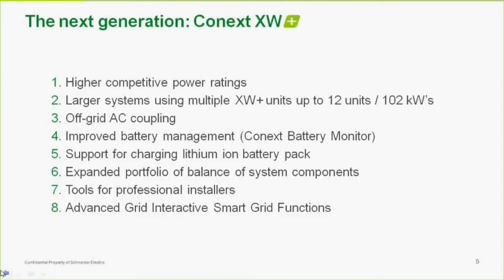But number two, we also have the ability on the inverter, and I'll show you the connection, to actually drive an external contactor. One of the challenges when using multiple battery-based inverters with an internal transfer switch is the paralleling of too many transfer switches. For instance, if we were to just think real quickly of a single XW6848, it has a maximum continuous pass-through capacity of 48 amps. If I was to cluster 4 of those together, that would give us a potential pass-through of 192 amps.